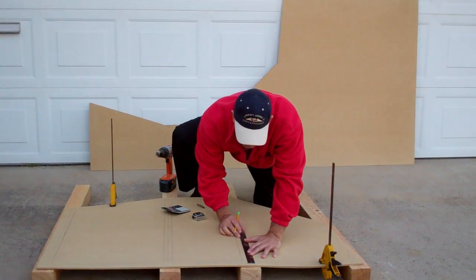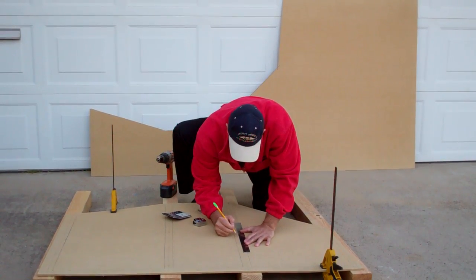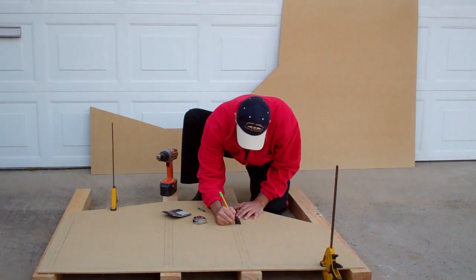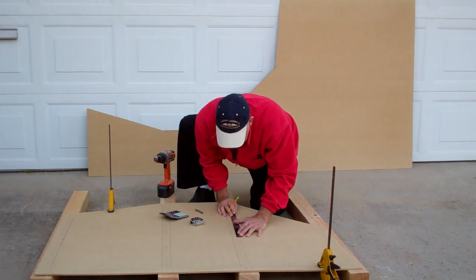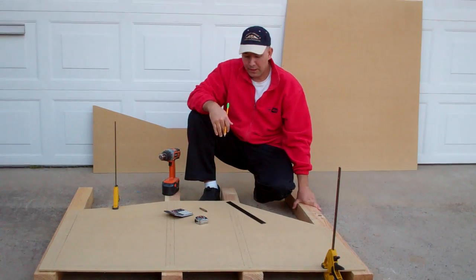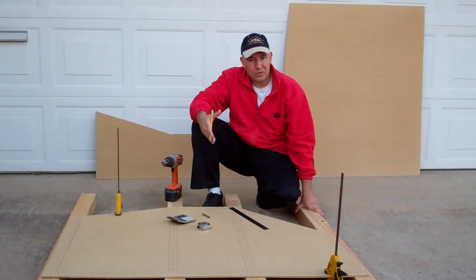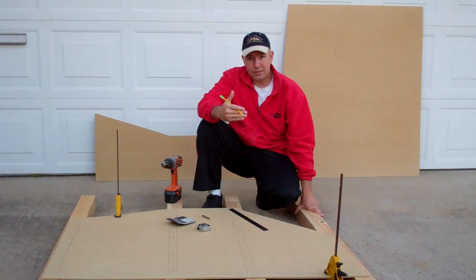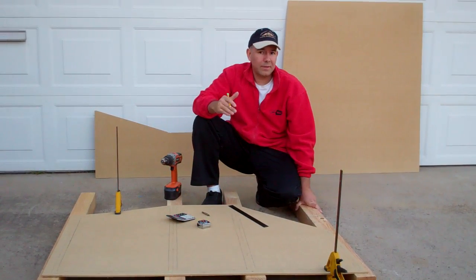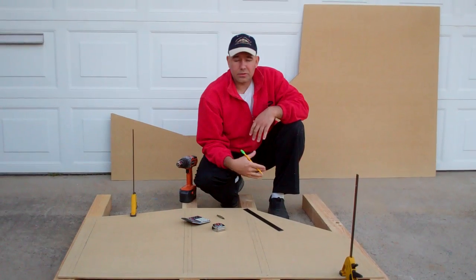You can round off if you measure and mark those from the outside in — then your center distance to distance would be a little smaller. Once you know what that space distance is, that's the space between your screws, and I'll now measure that off here. We'll then come the same distance starting from the other end at that first hash mark. Another mark there, another mark there, and so on. Those same two in the center should be almost the same or a little closer together, but all the outside ones are exactly equal. Basically, my builder manual talks about this in detail — this is one of the finer points of carpentry, how to be really symmetrical and get all your screws spaced nicely so that each spacing distance between each screw is exactly the same. I'd recommend practicing on a piece of scrap wood first if this is something you've never done before.